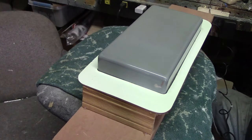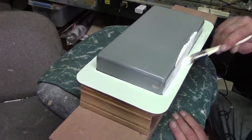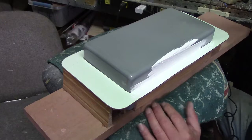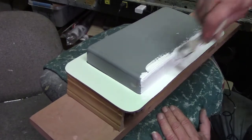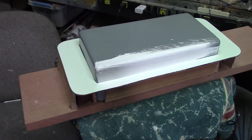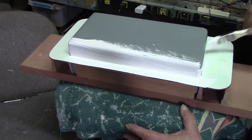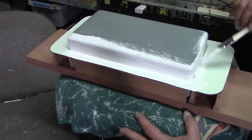Now you want to apply this surface coat. You think you want it on there real thick, but you don't — especially in these corners. You want to start out thin so you don't end up with any air bubbles. Basically you want to keep it — a hundred grams is probably way too much — as thin as you can get it and get a nice even coat. If you try and get it too thick in these corners you'll end up with bubbles, and bubbles mean voids, and you have to get out your Bondo and fix them. We don't want no voids.